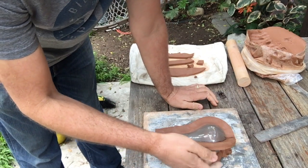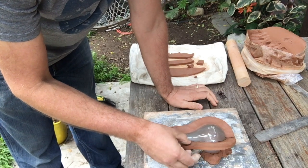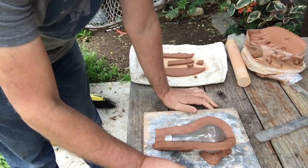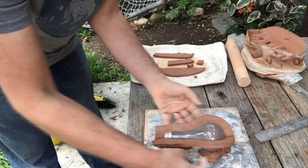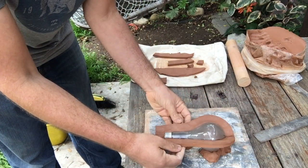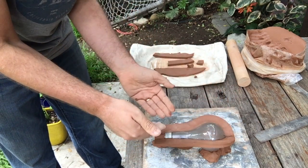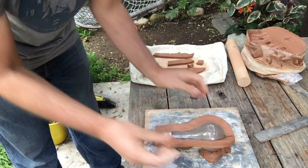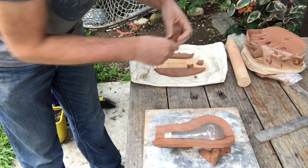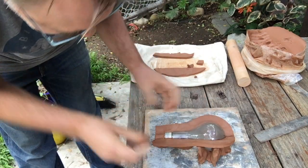Now, I don't want these clay walls to move once I start adding plaster, so I need to put support underneath them so that these can't fall down under the weight of the plaster. Okay, so some people do this differently. They build up a solid mass of clay and then they smooth out the top surface of it. I find that it's easier to roll out a flat surface, place that exactly where you want it, and then make a bunch of supports underneath it. So the supports can be just all the leftover clay that you have